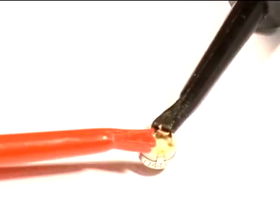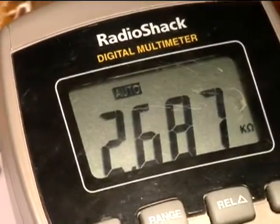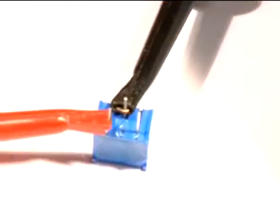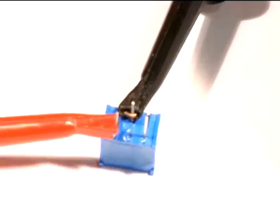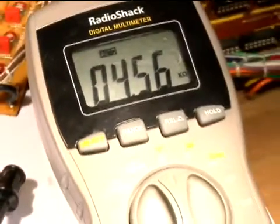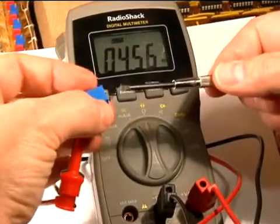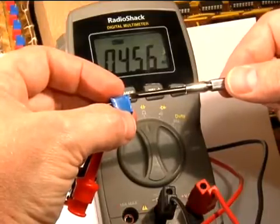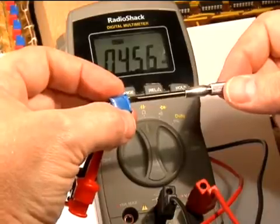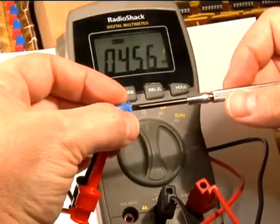With test leads attached to the top pin and the lower left pin, when looking at the potentiometer from the bottom, I have a resistance of 2.687 kilohms. With the new replacement potentiometer connected the same way — top pin and lower left pin viewed from the bottom — I get about 4.5 kilohms, since from the factory these are set roughly at midpoint. Using a small slotted screwdriver, adjust the new potentiometer to read the exact value the original had — 2.687 kilohms. Right now we're at 4.56 kilohms.